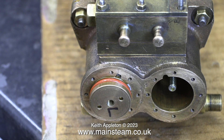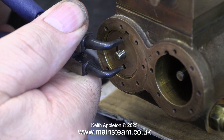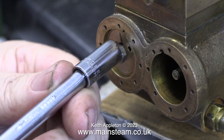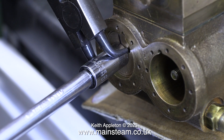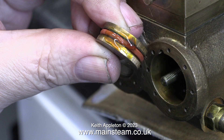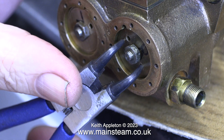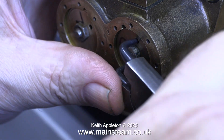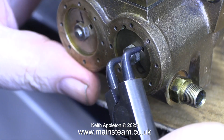What I did notice was the threads on one of the piston rods are slightly longer. When I screwed the pistons onto the rods using the circlip pliers as I showed earlier, the left hand one was fine. Using an extension to my screwdriver with the socket on the end, I'm tightening the left hand lock nut whilst holding the piston with the circlip pliers. Same procedure for the right hand piston — plenty of oil on the piston, plenty of oil in the cylinder. With one minor exception: the piston has gone too far down the thread, so before tightening the lock nut I need to wind the piston back a little bit so that both pistons look more or less exactly the same.